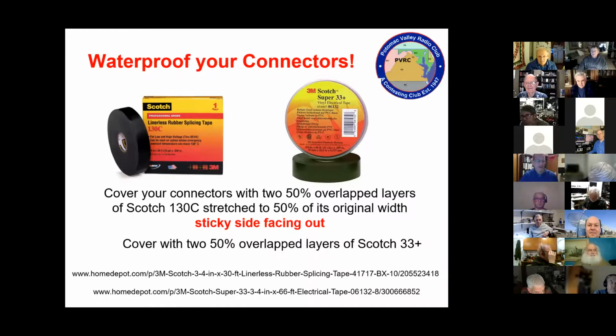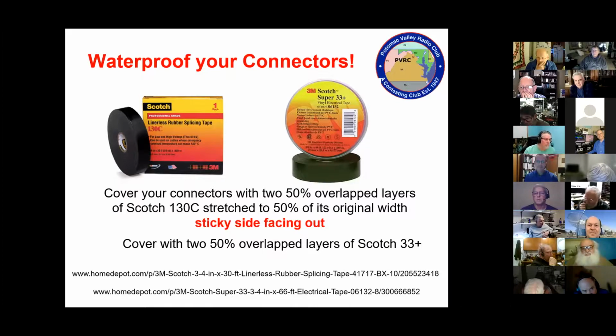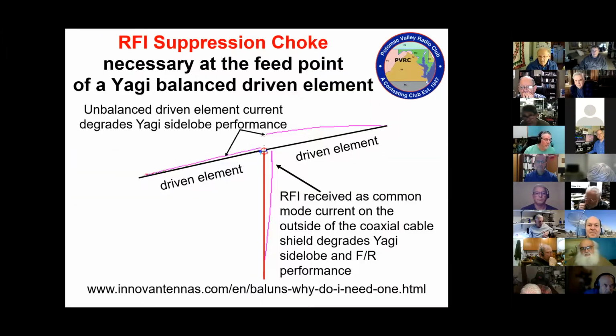What height should I be testing my new antenna at? We've tried this 6-element YU7EF Yagi for 6 meters. We've been trying it at various heights. We got it up to 10 feet. We know there's effects from the whole house and everything. But do I have to run it up to the actual tower height of 30 feet to get good knowledge that the antenna is even going to be tuned to the right frequency?